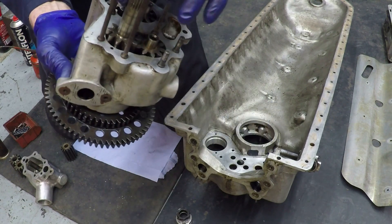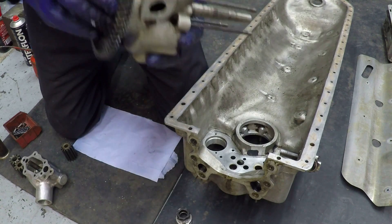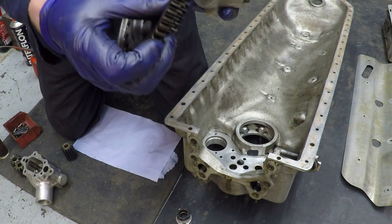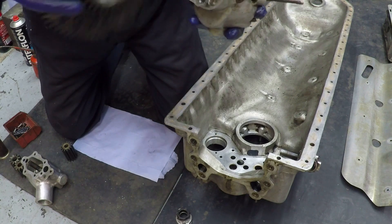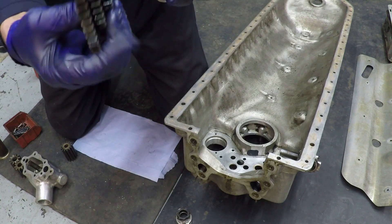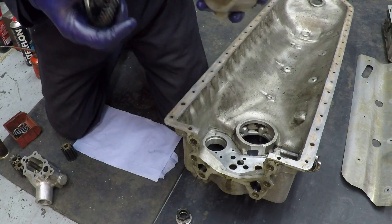The extended shaft there, which we'll see later on, will drive the oil pressure pump which is outside underneath the sump. So it's a triple gear: it's driven by the large one from the engine, that small one in there drives the second scavenge pump, and the middle one is used to drive hydraulic undercarriage pumps through this opening here, which again is something we'll see later on.